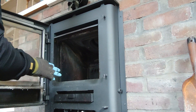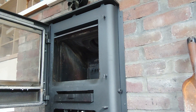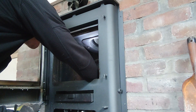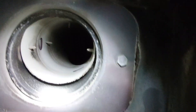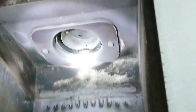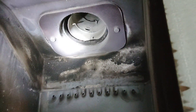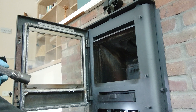This back brick comes out as well. It's always a good idea to take these out — sometimes you don't have to, like the one I did yesterday which would stay in position. But because the actual liner is right at the back of the appliance, I'll put the torch in so you can see it. As you can see, the liner is very close to the back. If you got your brush stuck and had to pull it down, you would knock that fire brick out of position, and the chances of it cracking are very high if it hits the metal floor.